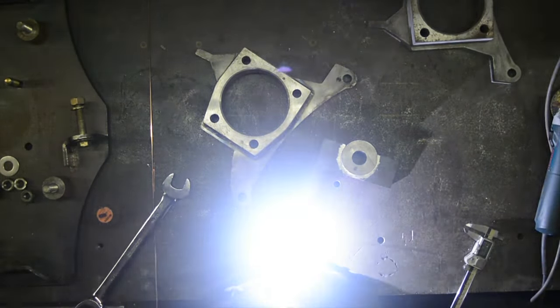Again, a couple more little bent plates, fish mouth for that tie rod slug rather, just fit in just like so. So I use those tabs I was showing you again, and I can just melt that in there for a quick little tack, and I can do it one-handed without having to add filler rod. Pretty damn handy having those in there.